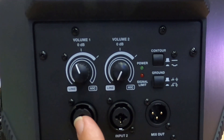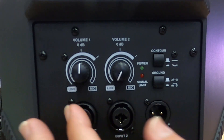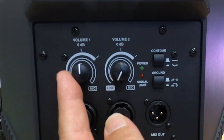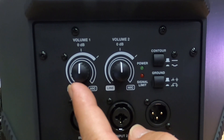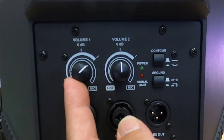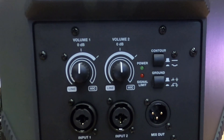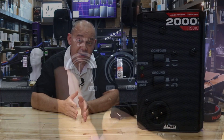If you're going to control the volume on your controller, mixer, or audio interface, set this to unity. If your volume input is fixed and you need this knob to control volume — like when DJing with a fixed playlist — keep it up at the top and use your controller or audio interface to manage volume. Once you pass unity, you're transitioning from zero to 100 to match the line input, then increasing above that into the microphone range. Unless plugging in a microphone, you really don't want to go much past unity.